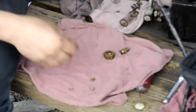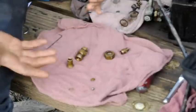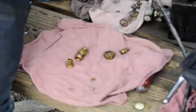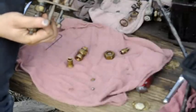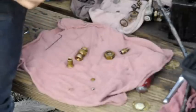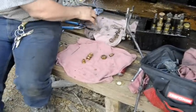Then you've got the oil that comes up out of here. It's really quite a cool system, actually. You basically have just pistons. When this goes down, it shoves oil up this tube and out through this little nozzle. Then when it gets into here, it gets sucked into here and pulled up into the piston. That's how it gets pushed out of these holes, which goes through all these mechanisms, then gets pumped into these lines. And it's good to go. Cool. So we've got good stuff squirting in there.